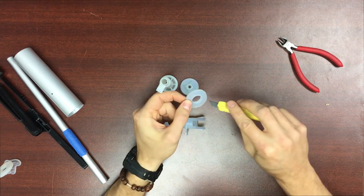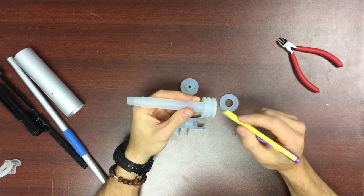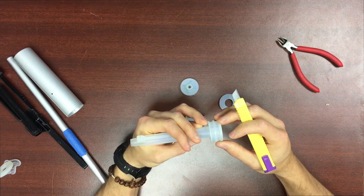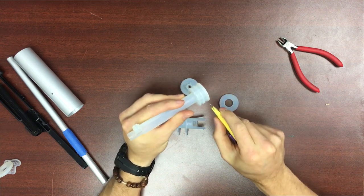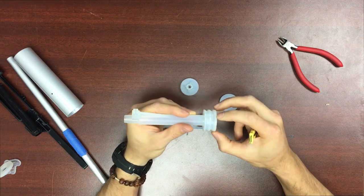I've already pre-sanded out where the plunger rod is going to go just to make sure I have good clearance. I've inspected the grooves for the o-rings to make sure there's no weird artifacts. There's a little bit of a ramp right here — it's not going to bother anything but you can always cut it down. The inner areas have been filleted so the o-rings will hold in place.